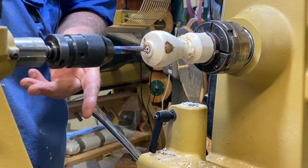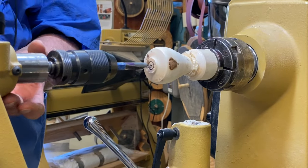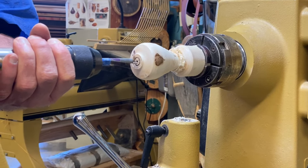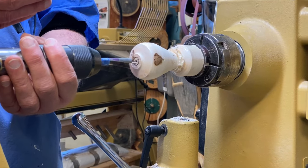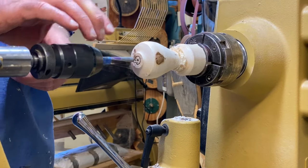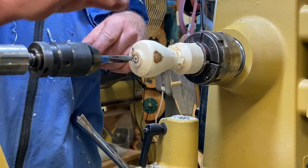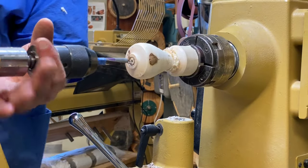So here we are. And again, seeing a demonstration with Dr. Charlie Sheaf in regards to hollow form, he made a very good point: whenever we're drilling, you need to wrap your fingers around the Jacob's chuck and then make contact with your quill. We're going to be drilling in, and then the drill bit needs to exit. If we have the Morse 2 taper separate here, you're going to end up with a wobbly, heavy Jacob's chuck in contact with your project, and it could rattle around and break out the side. So do hold on to both, all right?